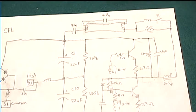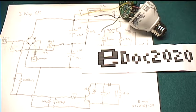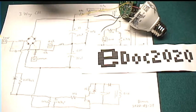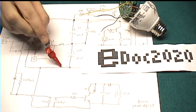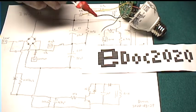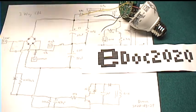Now I think just to better demonstrate, I'll try showing you some measurements of the circuit when it's actually powered. I just soldered some wires to some key areas of the circuit board. I have these black and yellow across the main power supply capacitors, and this green is connected to the base of the transistor controlling the relay.